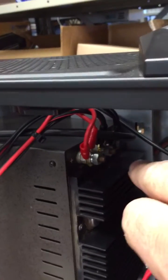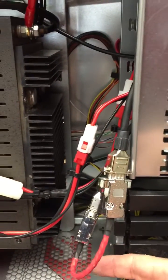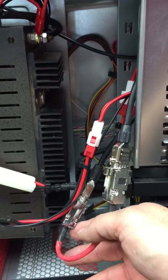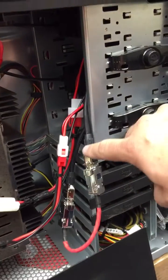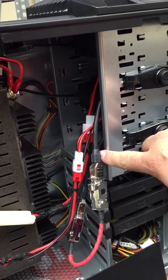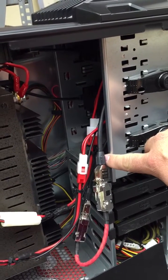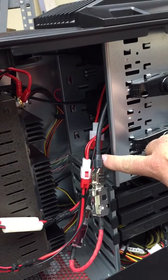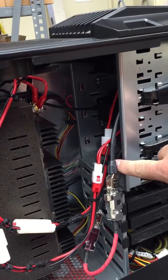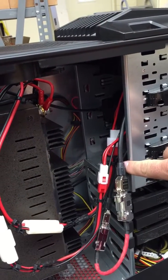The power cables from the radios are lugged onto the back of the power supply. There's a comms cable that goes between the radios — you have to make this cable yourself and solder it up. The pigtail cables you order them and they have to be installed inside the radio: take the backplane off the radio and push those onto a connector inside. There's also a coffee bean connector inside that has to be soldered across on each radio.